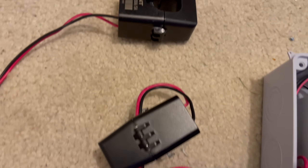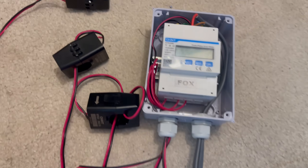We had some other teething problems along the way. At one point I blamed the software when it actually turned out it was my meter that was the problem. When I saw the symptoms you described, I was thinking this sounds like a CT-like problem for sure. And you were like, no, I checked it. Quite simply, when I put together the wires I had color-coded them for each phase, and it was the color-coding that was wrong. I should have double-checked. I got the meter out and checked across L2 and L3. Not dangerous — it just results in the meter not functioning as designed because it's seeing a different phase. So now the project is together, we've done some testing for a little while, and everything is working.